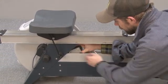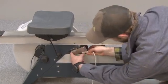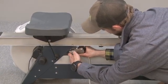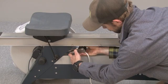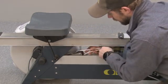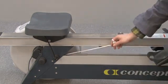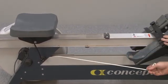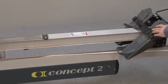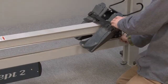Remove the shuttle pulley from the rail, feed the cord up into the bottom, and pull it through. Take the looped end and pull it forward all the way to the front of the machine, where you loop it onto the drive hook on the foot carriage.